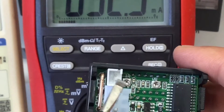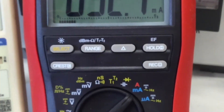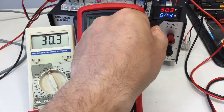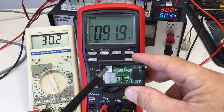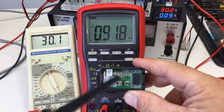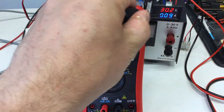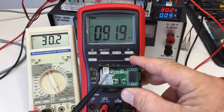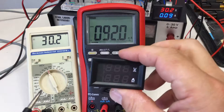I tested it at the 90 milliampere range — you can adjust for plus or minus 10 milliamps. But if you over-turn it just a little to one side or the other — it's a continuously spinning pot with no stop — you suddenly get fancy readings of zero amps or 2-point-whatever amps. So that's a little bit fidgety.